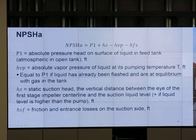Head vapor pressure, how do we get it? What do you suggest? Many times, I think Connor suggests using Google, right? I use it. It works. Use Google, okay? Net positive suction head, vapor pressure. Vapor pressure is a function of temperature, okay? I need that value. How do I get it? Handbook or Google. Google it. It shows me.